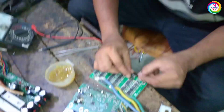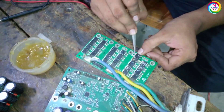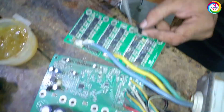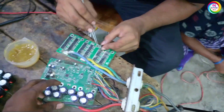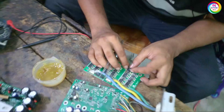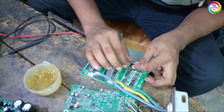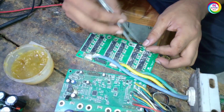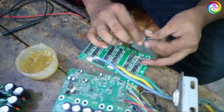If you look here, there is an extra part on this MOSFET. If you think this MOSFET is not needed for this type of controller, you cut this extra part of the MOSFET. After cutting and removing this part, the MOSFET will be okay — it will not damage. Then you can attach it just by heating, and this MOSFET will work fine.